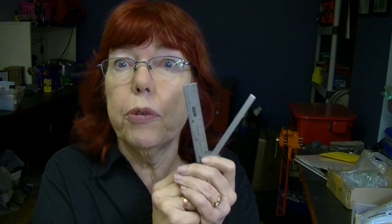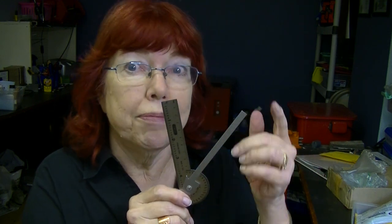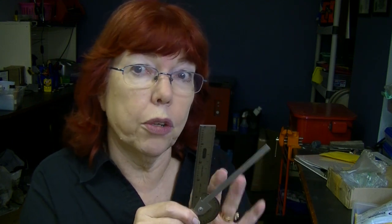But 45 isn't perfect for every shear for a number of reasons. If someone gives you a pair of shears and you have no clue how they use them, do a scratch test — I'll show you how — where you can see what the angle is on them, and default to 45. But doing a scratch test to find out the current angle might not reveal the best angle, because you're only finding out what the last sharpener designed for that shear, which may or may not have been the original factory angle. And sometimes the original factory angle is not the best angle for that customer.